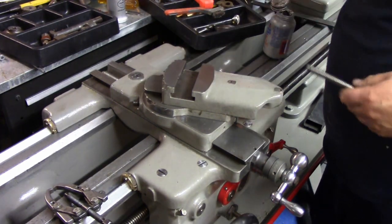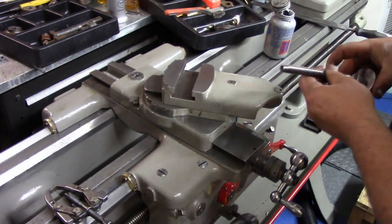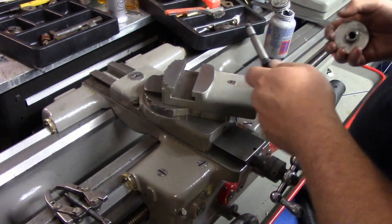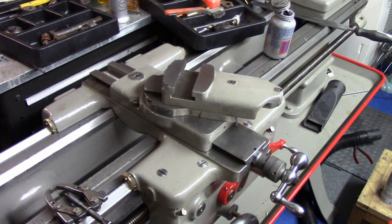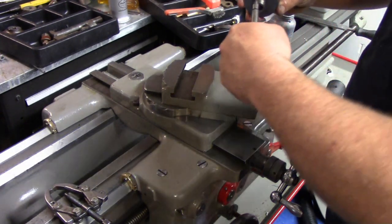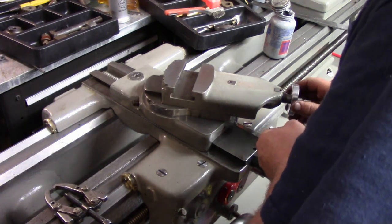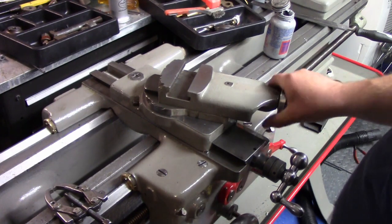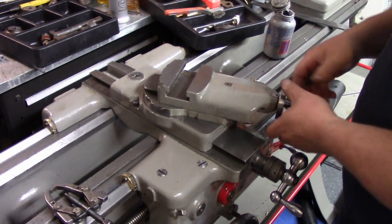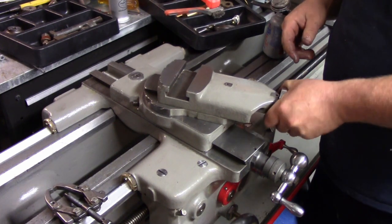Now I'm going to take our nut and our base - this is a large dial that one of my viewers had given me. I'm going to add a little bit of lighter oil to this and a little bit of oil on that shaft there, and I'm going to screw this in. I wonder if the zero lines up - it might not because it's a different machine that this came off of, and it doesn't seem to. So we're going to have to make a zero mark on this. There's a pin spanner on the side here, but we're just going to do it hand tight for now.